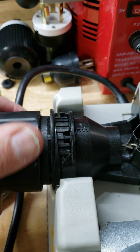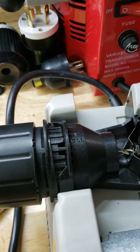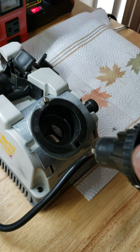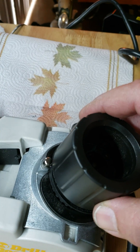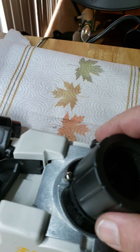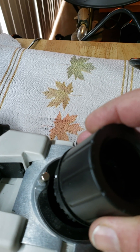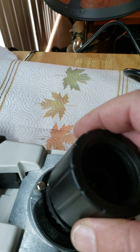Once you have your drill lined up and the jaws are catching the drill perfectly, you tighten the chuck to lock the drill in. Now we're all set and ready to sharpen. You see this white notch and this little stainless steel marker — you want to start right there and do even turns. Usually it takes about 30 turns to sharpen the drill; if it's smaller it won't take as much.